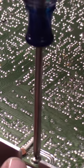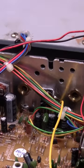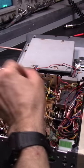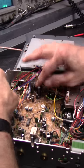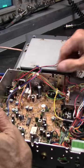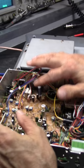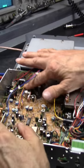I'm not so sure how long you had it, but those are still kind of loose. Back out a little bit. Filter. Ugh. I'm glad you got it in here. This is a nightmare. I got other videos too covering this and how the wires should not get put on top of the transformer. That can short out and melt the hell out of these wires. All it takes is this radio hitting bumps, and this transformer hits this. There's proper tolerance and clearance between this transformer and the amp when there's no wires in between.